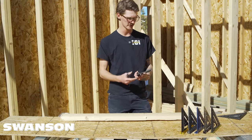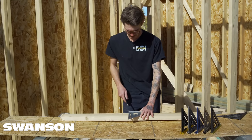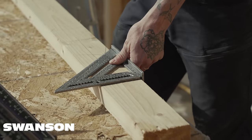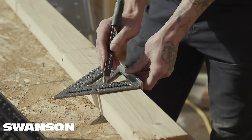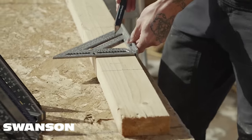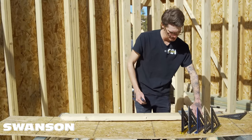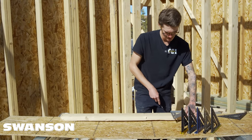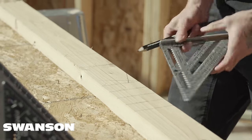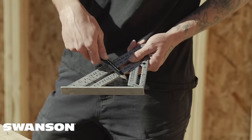It's super easy to read and super durable — almost the most durable square without spending a ridiculous amount of money. The reason I like having an inch-and-a-half notch is that for laying out walls you need to mark individual studs for multiple stud packs. If I scribe repeatedly and measure end to end I get compounding error, but if I line my pencil with the notch rather than the edge of the square, I'm exactly six inches — that's why I like being able to see the pencil line clearly.